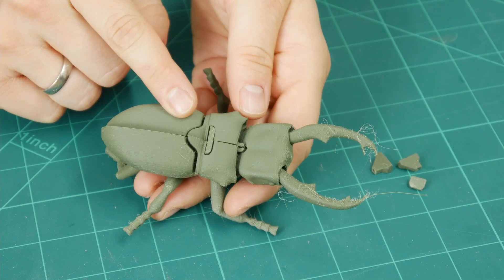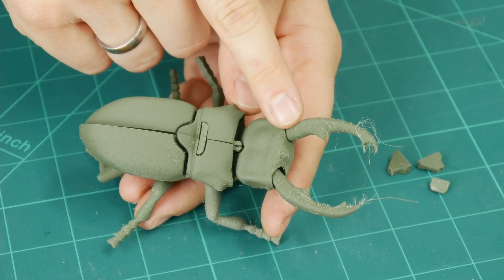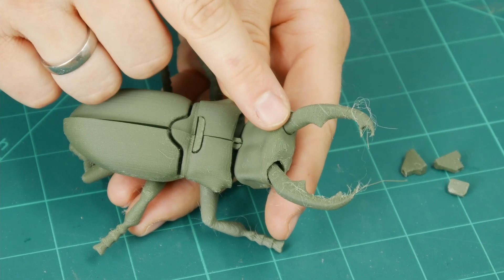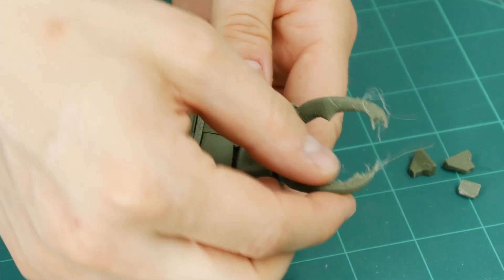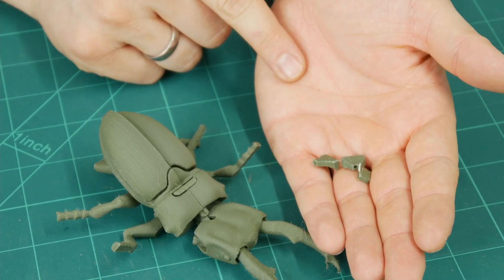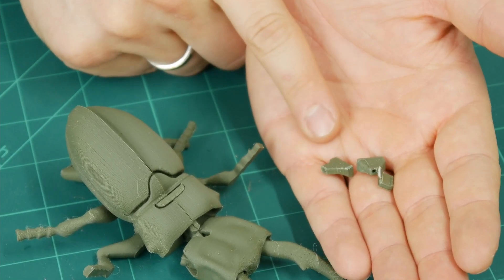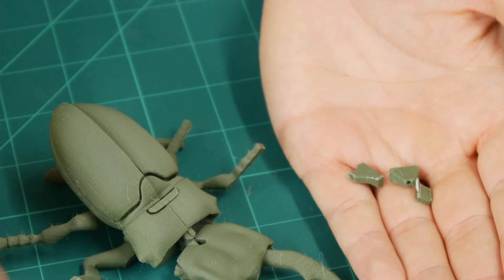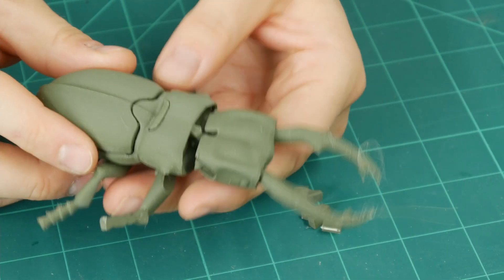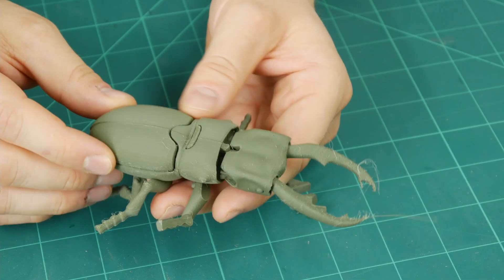I also printed a beetle without changing any filament settings. The horns on top came out quite stringy — they're the highest parts of the print and quite challenging. The strings are there but you can probably remove or burn them away. When removing the print from the bed, some parts actually broke off. BQ does warn that this filament is a little brittle due to its matte finish, so I wouldn't recommend it for load-bearing or functional parts.